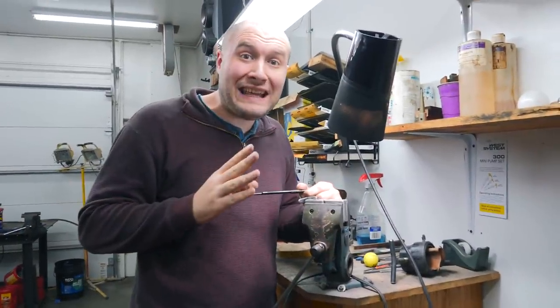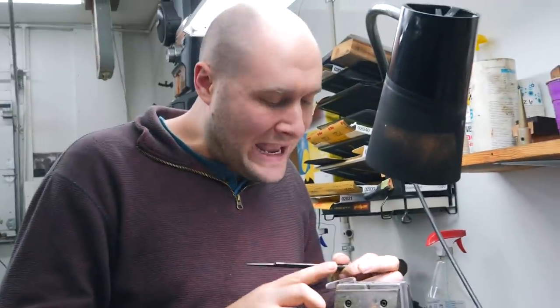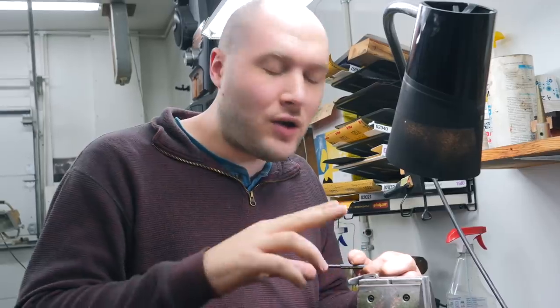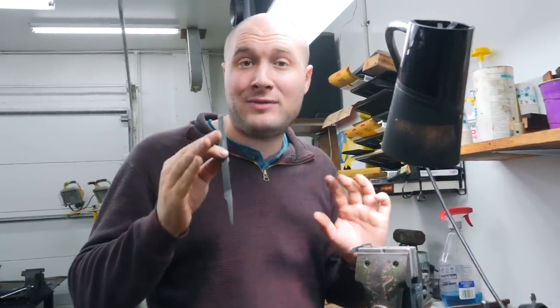I've got all the gold inlay done on all the fittings. So the next step I need to do is go ahead and hand sand the fittings and sand off the excess gold, get it all cleaned up. I'm going to start out with 320 grit and then we're going to sand these fittings all the way up to 3000 grit and get them ready for bluing.